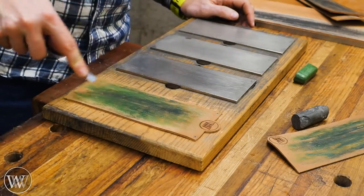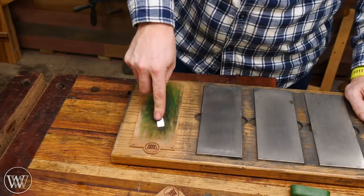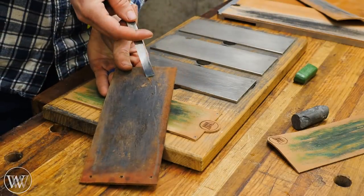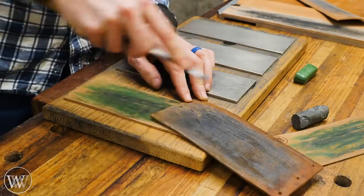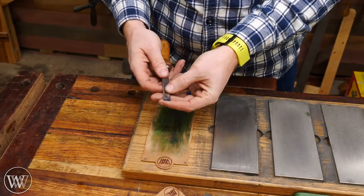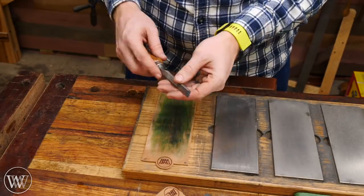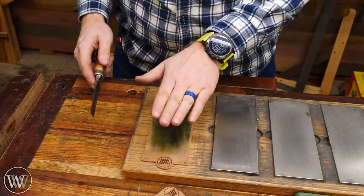I have to be careful sometimes when running the strop — if I go too fast, the chisel will gouge into the strop on the forward stroke. So you want to be careful not to go too far forward, or sometimes my forward stroke catches the back and actually shears up the leather. You can see several places on this old one where the chisel has caught it over time. Not a huge issue, as the more I come back across it, the more that will lay down. To me, the strop really is a vital part of any hand tool shop. It is the final thing that touches the iron before it goes to work, and in many cases the only thing that has to touch the iron to keep it up and running as long as you sharpen it more often.